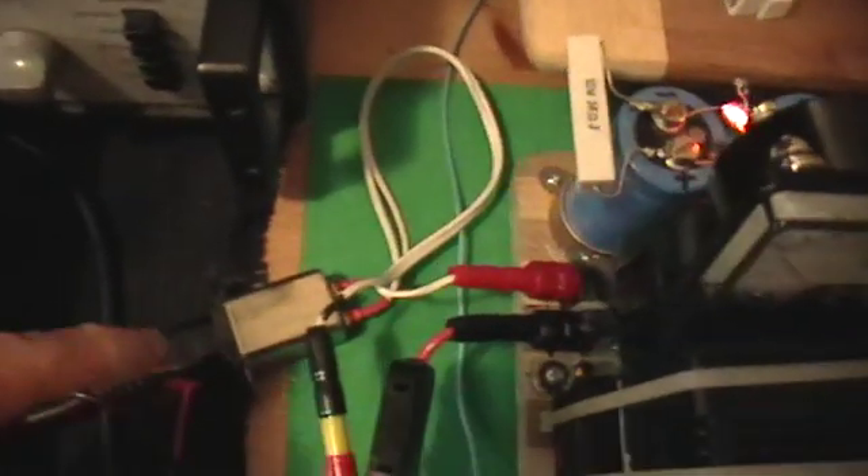This goes to the power strip over there, and we've got 170 volts DC coming out of the bridge and power supply. That's rectified. You run the line voltage through a bridge and then across these capacitors to smooth the ripple, and you get 170 volts no load. It drops down to about 150 when the thing is fully operational.